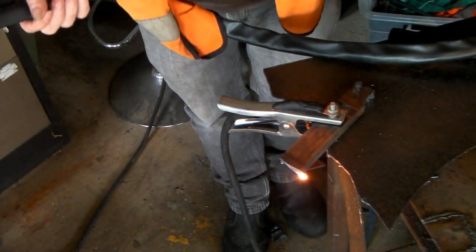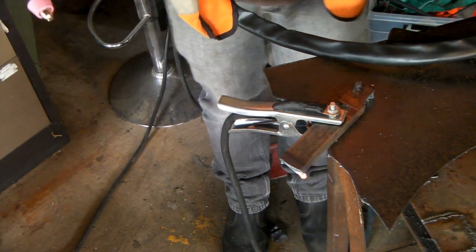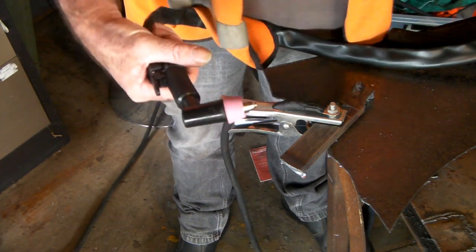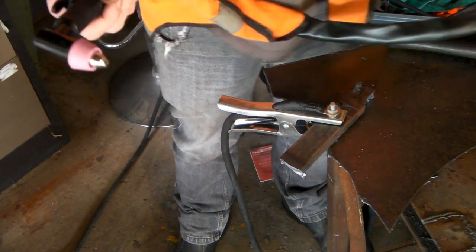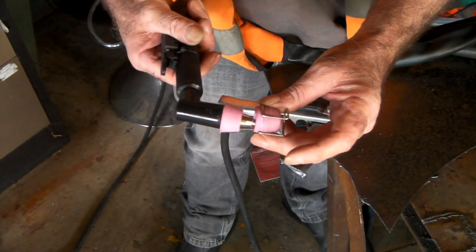See that — it's half inch. Just cut through that, not really an issue. It wasn't a hell of a fast cut but it does go through it, no problem. So yes, I would take the guide off when doing thicker stuff, and when you're doing thinner stuff put the guide back on again.